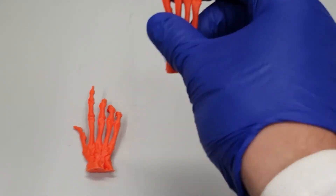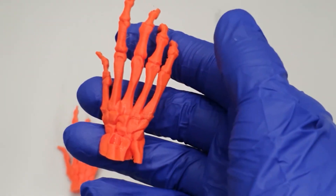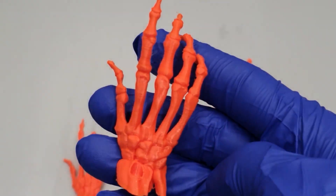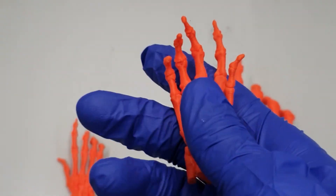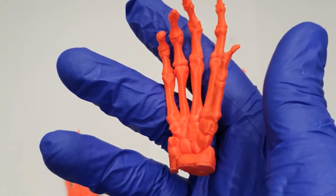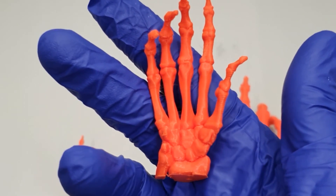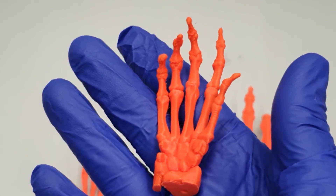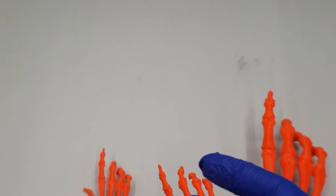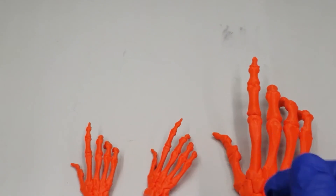Because I'm doing lost PLA bronze casting, I was experimenting with different solvents to smooth my prints and found out that dichloromethane works the best. The nice thing about DCM, as it is called in a laboratory, is that it is available to private individuals and with the proper safety precautions can be handled safely and easily.